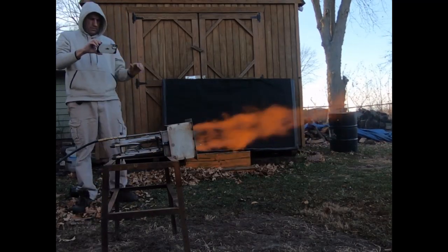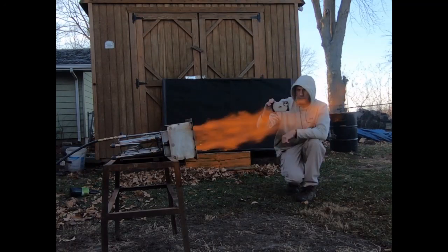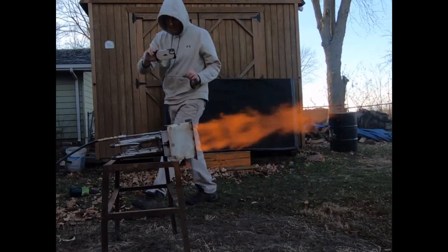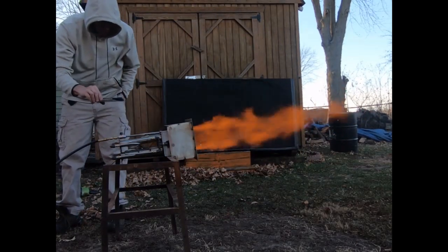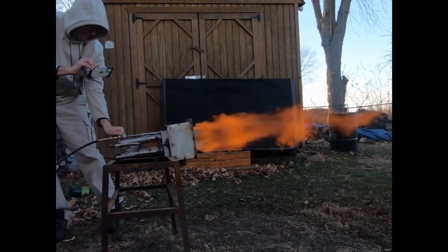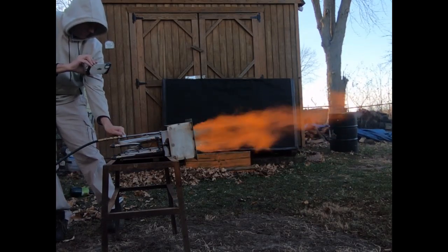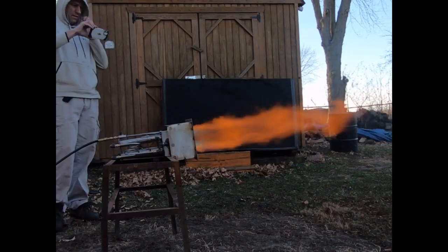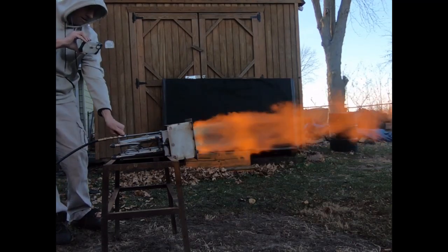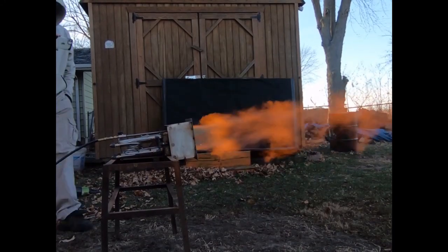This is an industrial burner — it's not made for just kind of messing around with. But you can see here on the low setting, it does pretty well. I believe all that color we're getting is from the mercaptan and the oil that you can get out of propane. Because we have that bottle inverted, all the gunk that was in the bottom of there is definitely being burned. You would definitely want to run this on a pretty good propane system, and it might even help to have an oil separator.